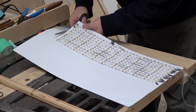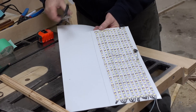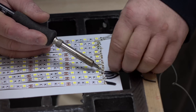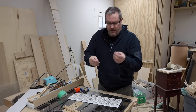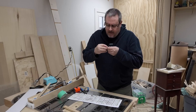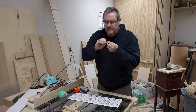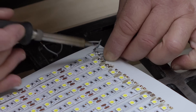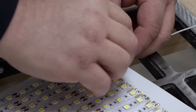I'm just going to use scissors to cut it — that's the beauty of aluminum flashing, you can cut it with just about anything. I'm going to daisy chain the strips together in parallel. I've cut short wire pieces and stripped the insulation off, and now I'm going to twist the ends together in a Z pattern and then solder those together. That way I'll connect each strip individually — I'll do all the positive tabs first, then all of the negative tabs the same way.